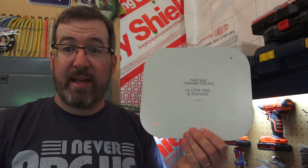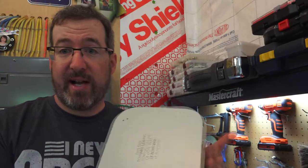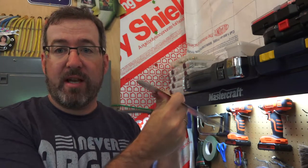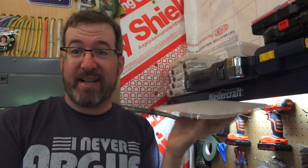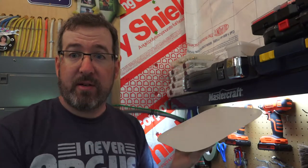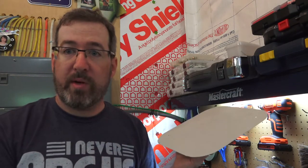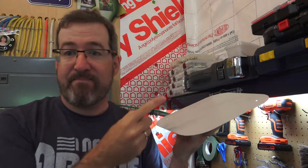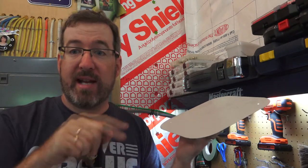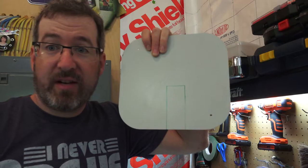Here in the garage, I've got this plate that came with my garage light — it goes up against the ceiling and I already had one, so I ended up with this extra one. It's fairly heavy duty but easy to cut with a grinder, and we could probably make 15 plates out of this if we wanted to. I'm going to take the Arca Swiss mounting plate, put it on here, take a measurement, draw out what we need — adding a quarter inch to each end for the bends — then stick it in the vise and cut it out with the grinder.